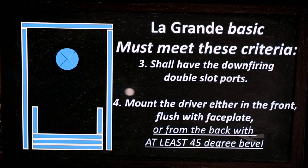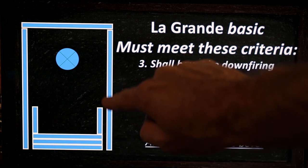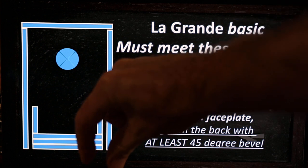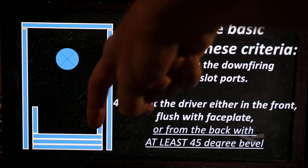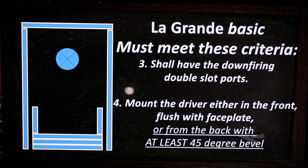That's a key feature of this La Grande build — if you change it, it's not La Grande anymore. The width where the air can go in and out is 15 millimeters — the space between the side wall and the wall created by the bottom and the slot wall. Constructed this way, it gives an approximate tuning frequency of 40 Hz, which digs down quite a bit deeper than the Le Petit, which tunes at 48 Hz using the same modeling software. So you're getting almost 10 Hz lower reach than Le Petit.